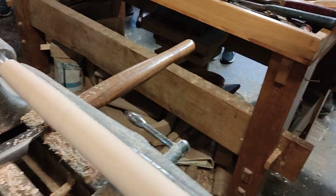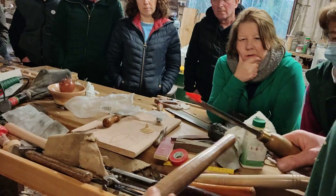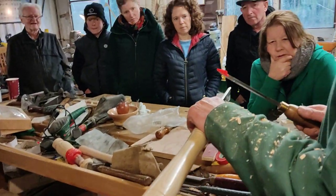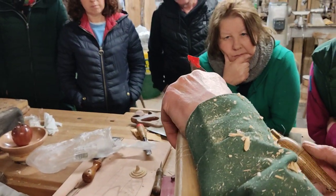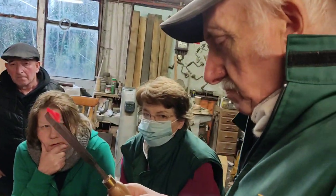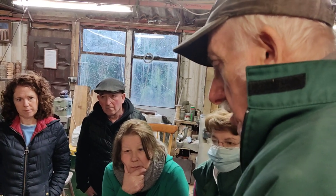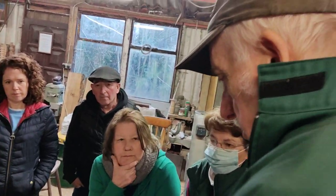You see, if you take it, hold on, I'll get a better tool rest on it. Using more blade, seeing that there's my tool rest there, and I'm up in there like that. If this point up here catches a wee bit, that'll come down, and it'll cut a hole in the wood and ruin the bit of wood. But it'll give you a fright. And these frights build up for other people, not even with skews but with different tools, and they lose the will to do it, which is silly. Remember, this is all to keep you away from there.